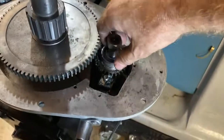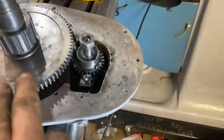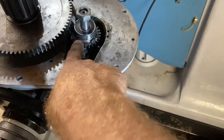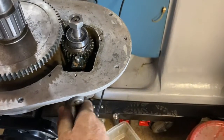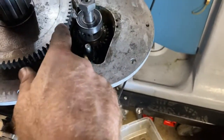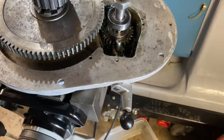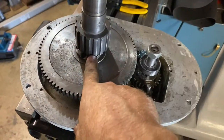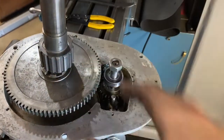This pulley wheel — the belt will go around that shaft, and it will turn this part here like that. As that pulley turns, it will turn this gear down there, and this pulley here normally is all the way down flat, and those two have the ability to engage. This is your forward and your reverse gears. So when that is down, it does not engage with this, and the only way to transmit power is here. And when it's up, it will engage. At that point, if both this and this were selected, then the engine couldn't turn because it's trying to turn it both ways.